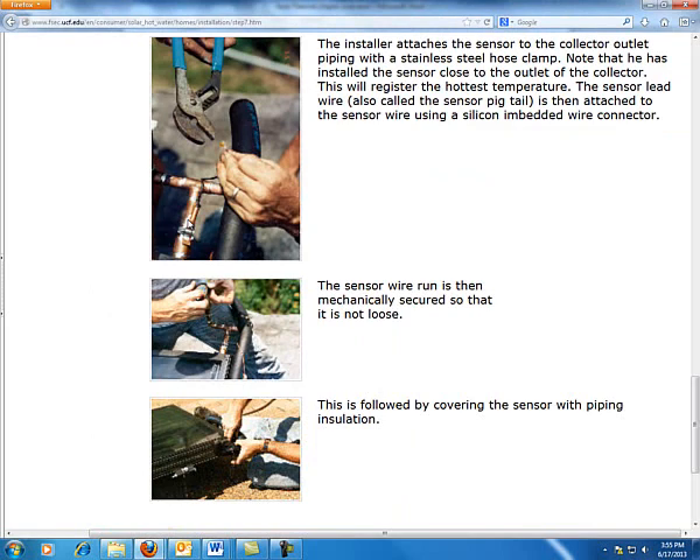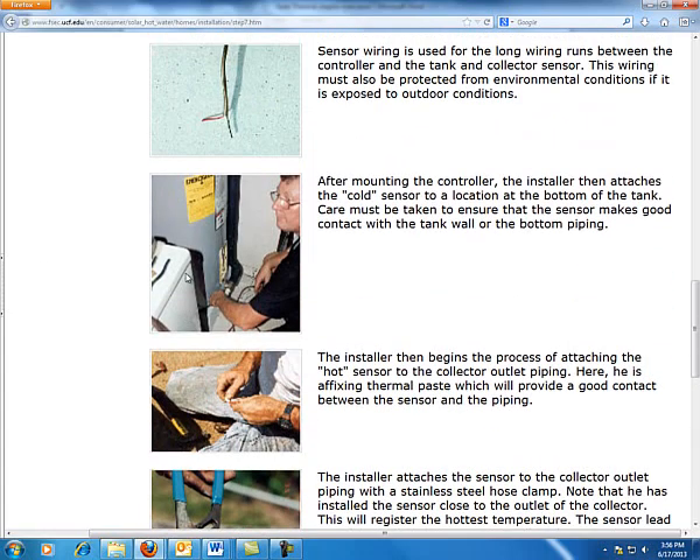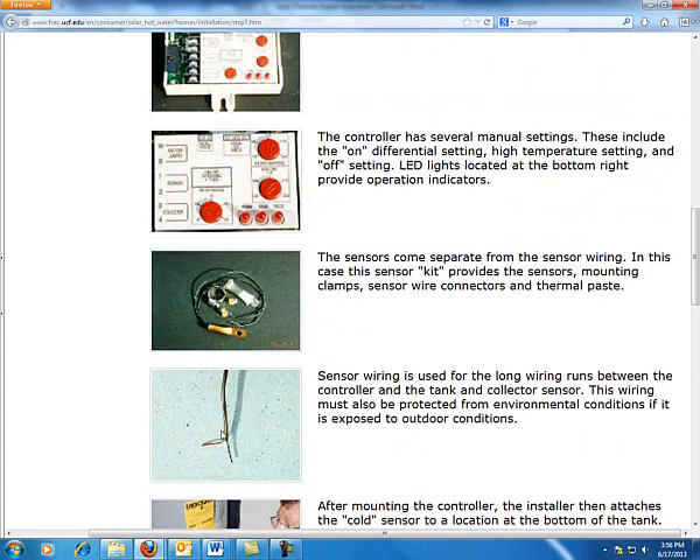Yes, there's a big science behind it and a lot of other things to consider. But the moral of the story is we want to measure the temperature. At the end of the day, there's going to be a thermal mixing valve that mixes cold water in with the stored hot water so we don't scald anybody on the domestic hot water side. For the typical residential system, we want to make sure our install has proper sensors, a proper differential controller, and decent sensing wire. Those are our main ingredients for a successful installation.